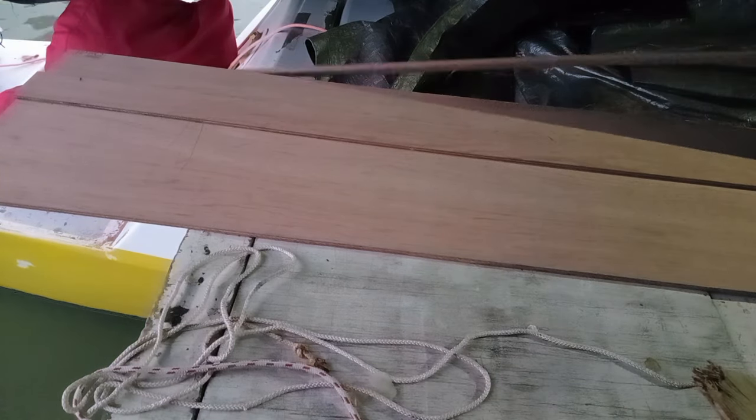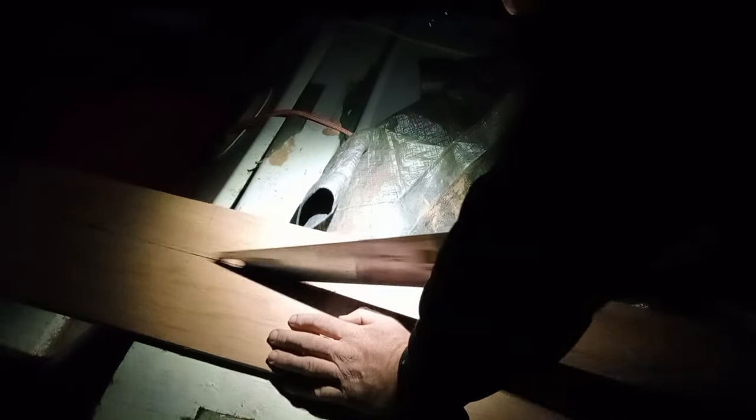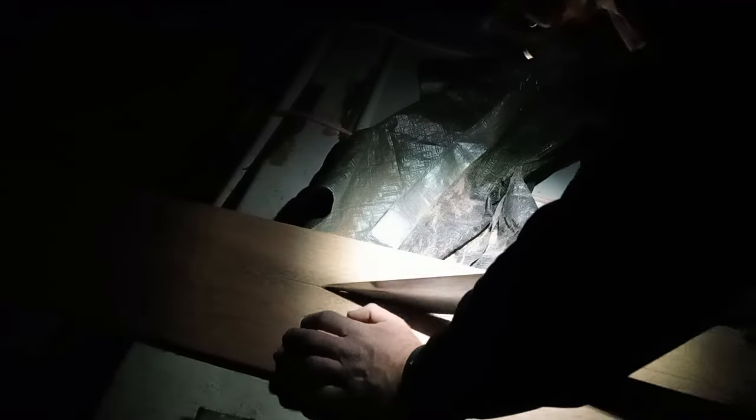The first step was cutting the plywood into long strips. It took a little while to cut out with a handsaw. I prefer to use a handsaw for something like this rather than a jigsaw — because jigsaws vibrate a lot and it's actually quite difficult to do a straight line, whereas a handsaw, because it goes slowly, you can follow the line very closely.